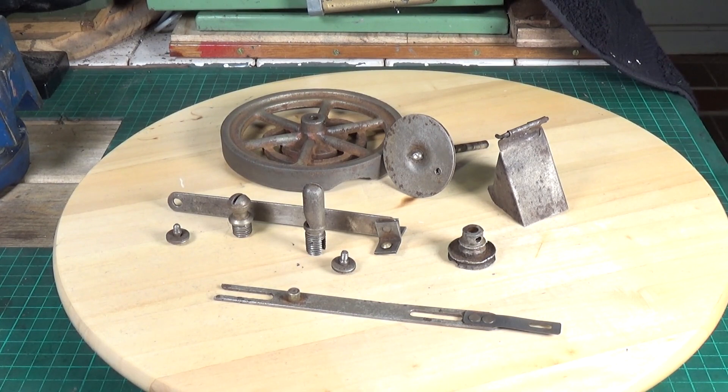I'm very pleased with that - well worth the effort. Two days I left it, and as I took the parts out I used a soft brass wire brush to tease off any remaining rust that hadn't floated away. Those parts are ready to hit the wire wheel for the final cleanup. I've still got to do something about the casting - I think that's going to have to go in the grit blaster because it's just too big for anything else. But we've made a start on it.